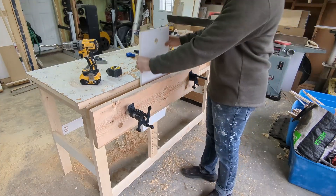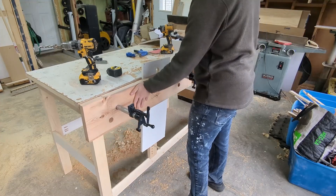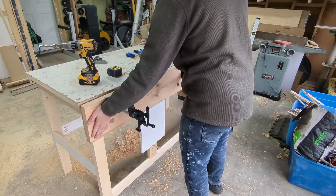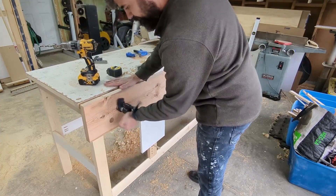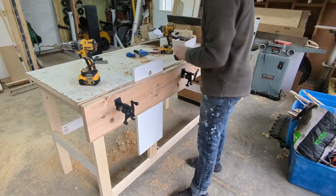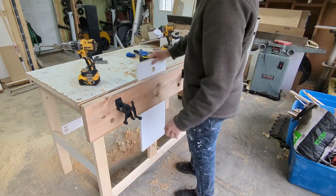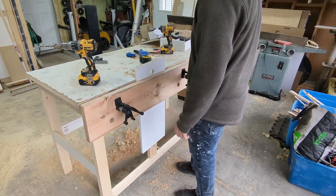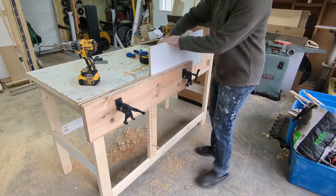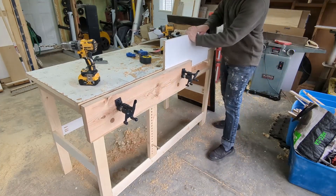With the jaw reinstalled, it's easy to see how we can clamp smaller panels in between the two pipes. If you're working on parts that are all the same size and you're performing repetitive tasks on the same edge, the dead man can come in handy for acting as a positive stop. The first step would be to insert one panel and set everything up so that the dead man and the clamps are positioned where they need to be. Then it's super easy to remove a panel, install a new one, do your work, and repeat. Finally, if you need to work on a panel that is shorter than the distance between your pipes and it may want to fall through, this is where our half inch holes along the top edge come in handy — toss a dowel in there and you have a quick support to hold your workpiece while you tighten up the clamp.